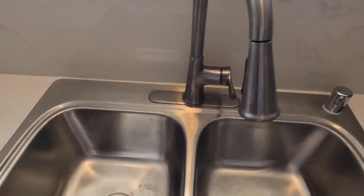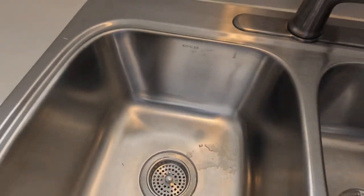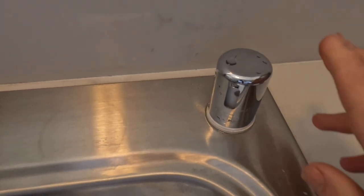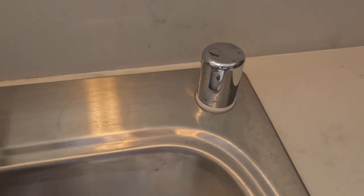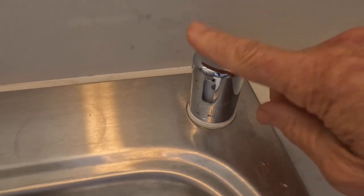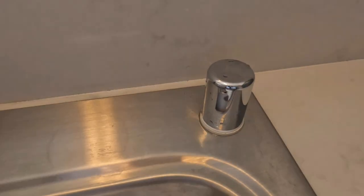So we've got $200 for the faucet, $60 for the strainer, and $200 for the sink. This is just a Danco air gap — I couldn't see paying an extra $10 to get a Kohler air gap since it's a non-moving part. You can get them in chrome or whatever finish you need. An air gap creates separation between your water supply from the city and possibly contaminated water coming from your dishwasher. It is code in most areas to use an air gap, and it also creates better water flow.